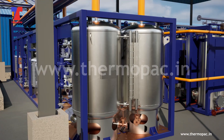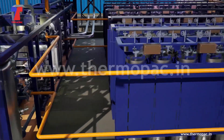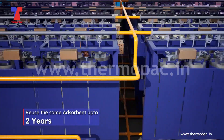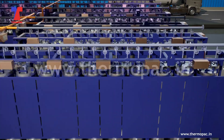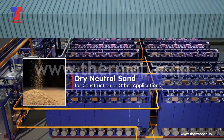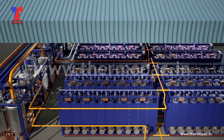The absorbent columns after oil processing. Its automated reactivation allows the plant to reuse the same absorbent for up to two years. Once spent, the absorbent can be disposed of as dry neutral sand for construction or other applications.